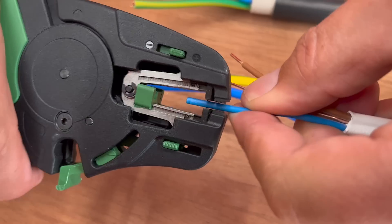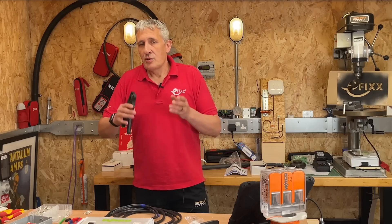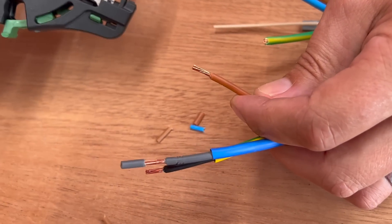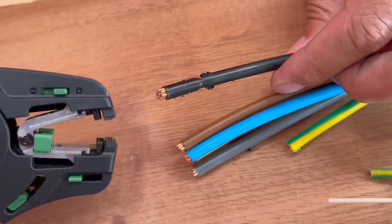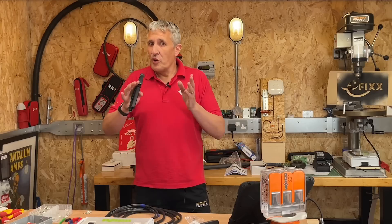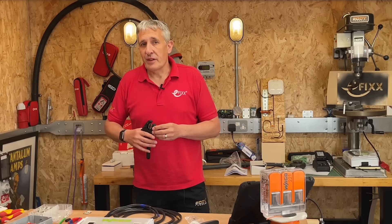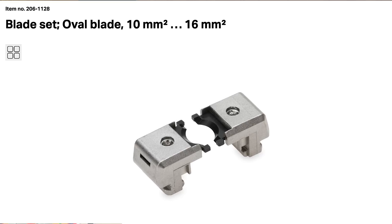Based on our tests, this tool works best with smaller diameter XLPE conductors, like 1.5 millimeter squared twin and CPC cable as well as 2.5 millimeter squared SWA cable cores. However, as the conductor diameter increases, the tool struggles to strip 16 millimeter squared due to the flat construction of the blades. Fortunately, Wago provides alternative blade options, including an oval-shaped blade designed specifically for 10 and 16 millimeter squared conductors, so we'll see if we can get a set of those and report back.